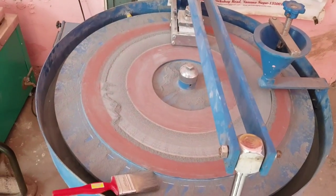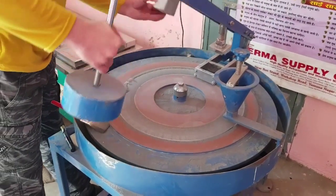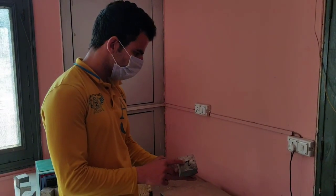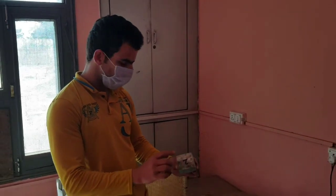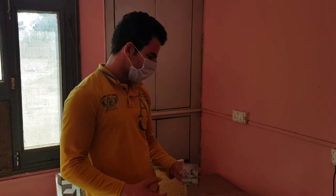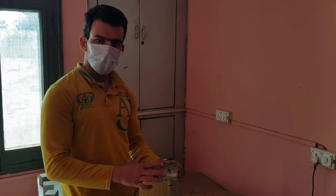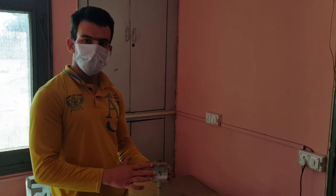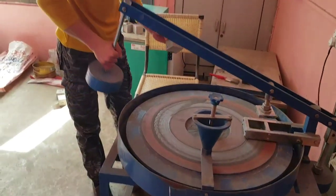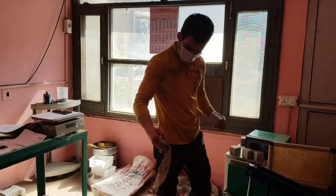The rotation of the machine has stopped after 22 revolutions. Now we have to rotate this block clockwise for the second side. After that, the same procedure will be done — the side will be placed on the grinding pad, again 20 grams of abrasive powder is strewn, and 22 revolutions will be made. After finishing the revolutions for all four sides of the block, we measure and note down the block dimensions. After completing the test on all four sides, the block has to be cleaned.